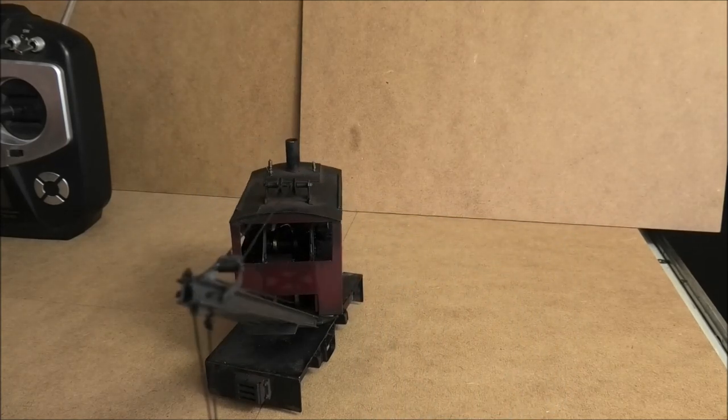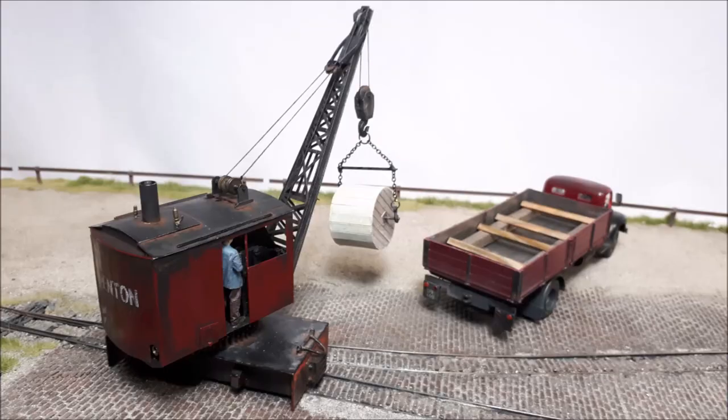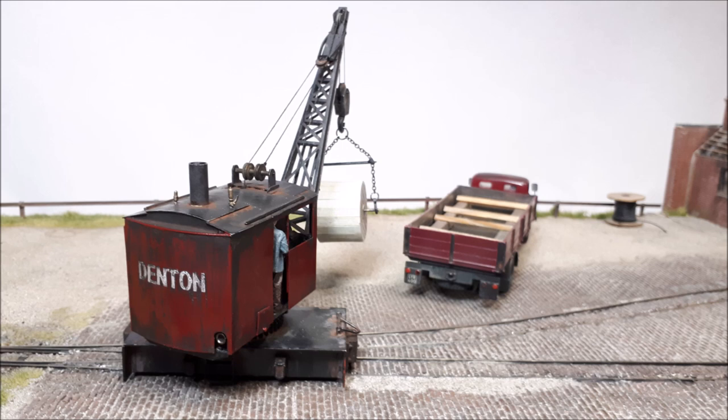This balancing exercise was, however, entirely successful, and the steam crane has never toppled in service and successfully works through 360 degrees. It should be noted that the jib is comparatively short at 145mm. Operationally, it would be very useful to have a longer jib, as it would allow lifting higher and further away. However, as it turns out, this length has proved perfect for use on narrow gauge, as a longer jib would certainly cause the crane to topple over at full reach.